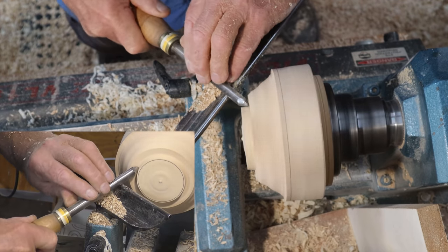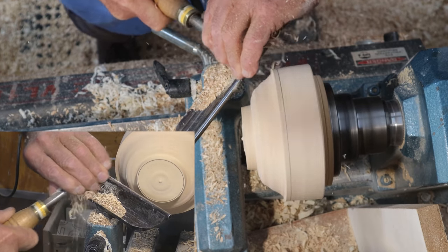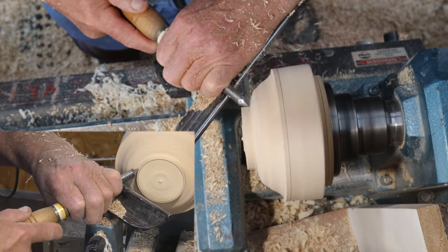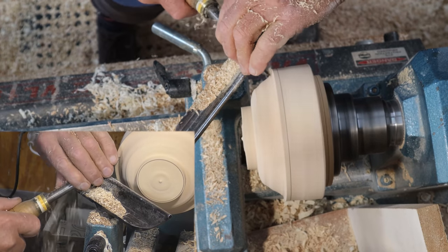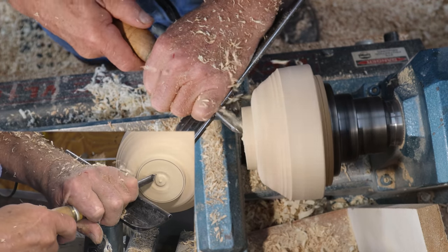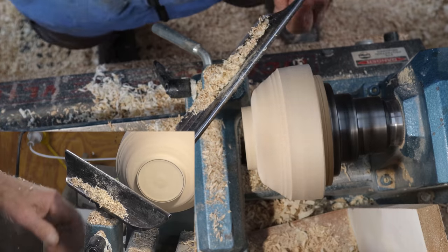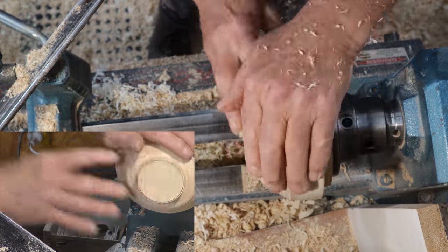So at the end of that cup, the tool's right on its side, squeeze it back, and then the jaws will seat right in that corner. Doesn't need to be dovetailed, it can just be straight in, and that'll be fine. And that's really all I need to know at the moment. I'd like this flat on the top or slightly concave. So that's the lid section done.